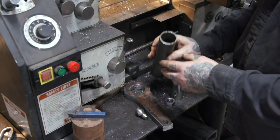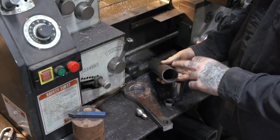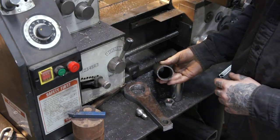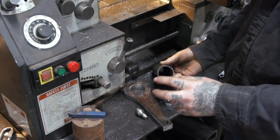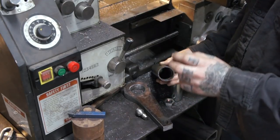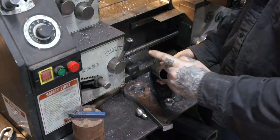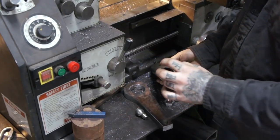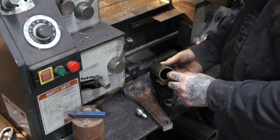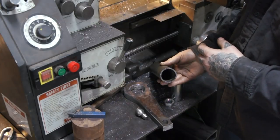The other problem that we overcame was that I wanted this tubing to be as small a diameter as possible. We could not fit the nut in stock form in here with the socket that it needed. The nut fit inside, but the thickness of the socket wasn't going to fit, and the tubing that would fit, at least a quarter wall, was too large. It was going to look really bulky, and I didn't want that look.